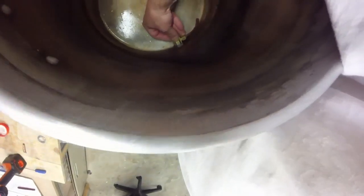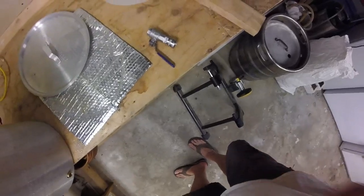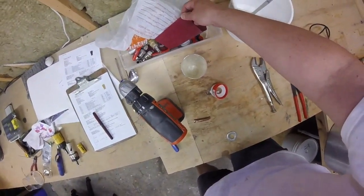So what I'm going to do is I created my own pickup tube. The electric brewery is sort of on the back burner for a little bit — I had some unforeseen expenses with the kids' teeth coming down the pipe, so that's on hold. I took one of the 90s off, grabbed a piece of copper that's going to fit in there like so — that's going to be my pickup tube. That stainless steel washer is going to go on the front along with my ball valve. And I'm going to make my own gasket out of old silicone baking sheets, because they're cheap and those gaskets will last forever. As soon as they start to leak, you can just make a brand new one.